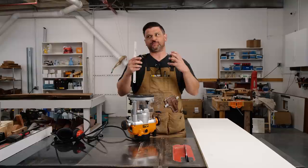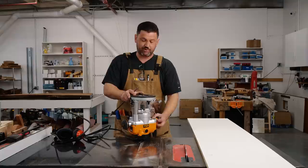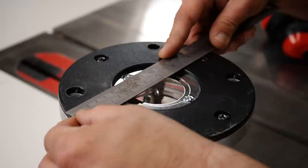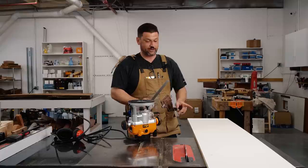The first thing we're going to do is build the sled that will hold the router. You don't want a lot of slop in this, but you obviously don't want to make it so small that the router gets stuck. What I like to do is put a bit with a point on it in my router, bring it up just below the surface, and use two screws and the tip of that router bit to make sure I'm at my widest spot.